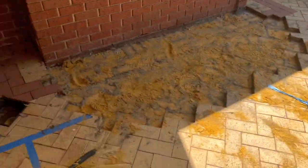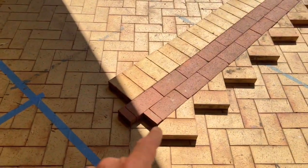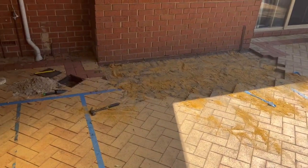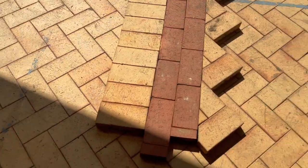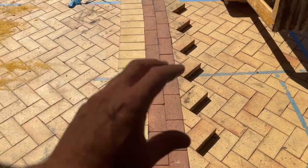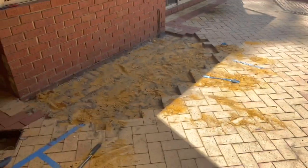We've just pulled up all the pavers here. You can see how all these pavers have been cut all the way. A really good way if you are ripping up pavers is to pull them up and then place them down exactly where they go. So all these little cuts - you know where they go back. Once we've dug it all up and finished, we can just pick up these pavers and transfer them straight back. Otherwise you're worried about where this little triangle goes and how it all works out. Get the bulk of the pattern done - the rest of the bricks are all solid, so we just made a big pile of those.